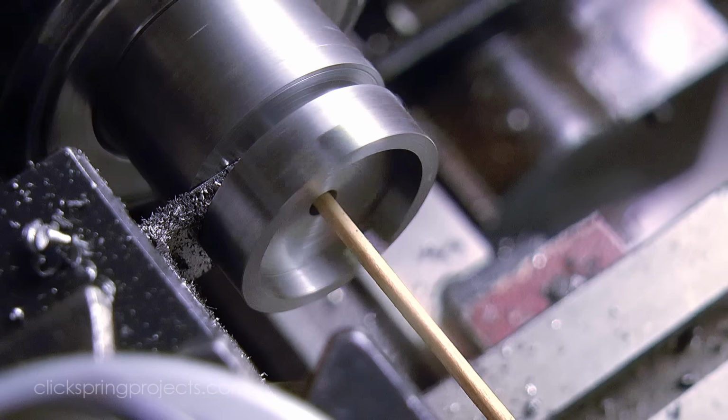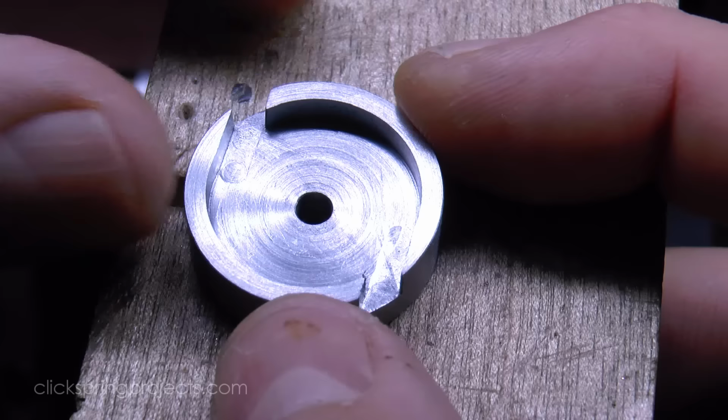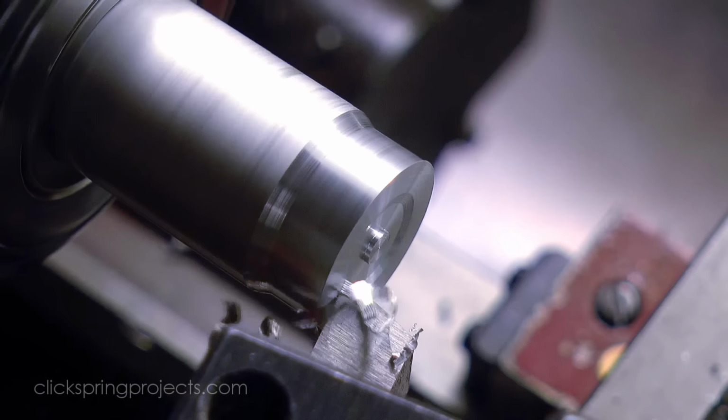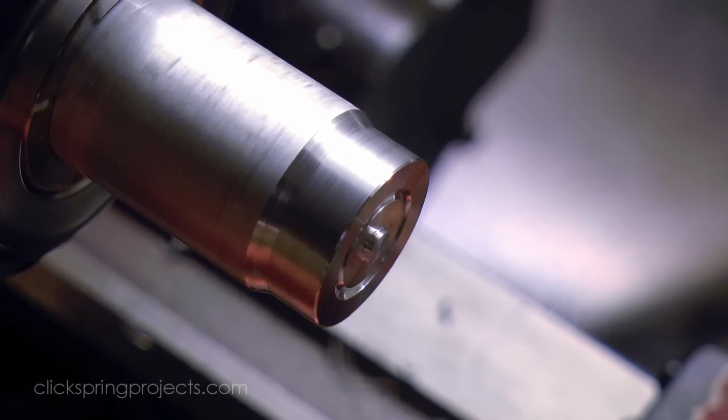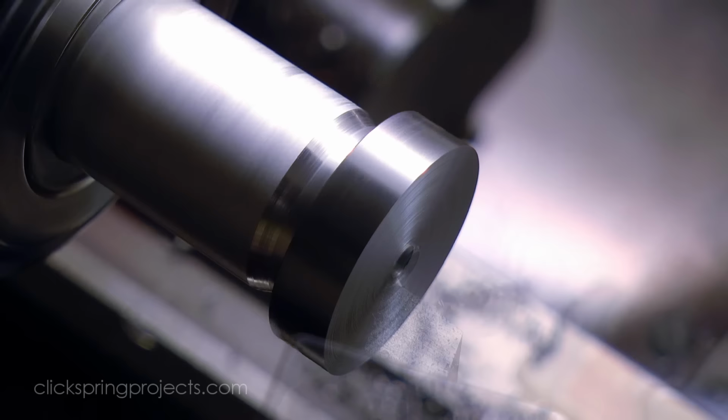In addition to the material itself and the width and height of the spring cross-section, this sets the spring's performance characteristics, which then guides how the spring can be used. For example, a hairspring can be matched with a balance wheel with a suitable moment of inertia, so that together they'll give a desired period of oscillation and otherwise meet the design requirements of a particular watch. Or a spring can be selected based on its ability to provide a suitable restoring force within a small gear train, like the sort found in a dial indicator.